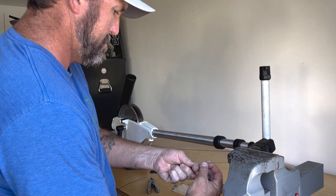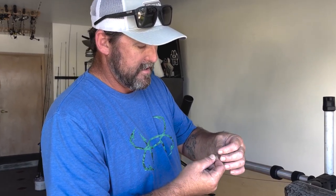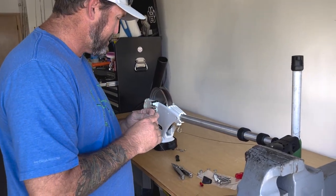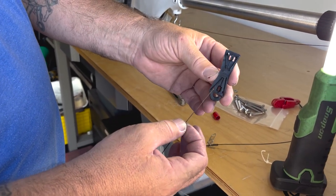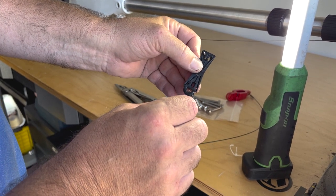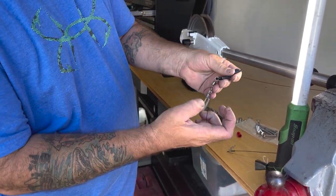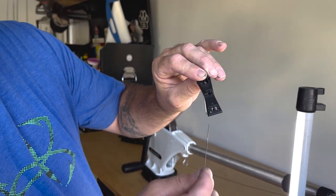Here's the part everybody was probably waiting for. You don't want to fray this end — try to keep this end from fraying on the cable. Do not forget the snubber piece; slide that on first. Here's the terminal end — you got one, two, three holes. You're gonna come from the back here, down here, around, up, back in, and down. So don't forget it — slide this on. You can do it now or after this next step. We're gonna put it in this side. Can you see those holes? There's one, two, three. We're gonna put it in that side and feed it through.